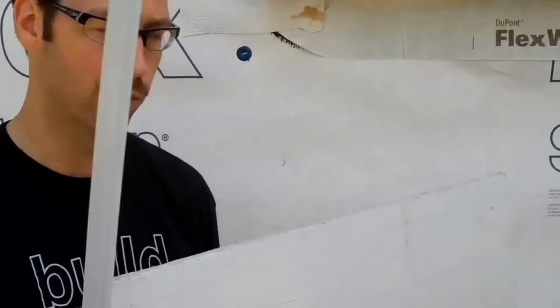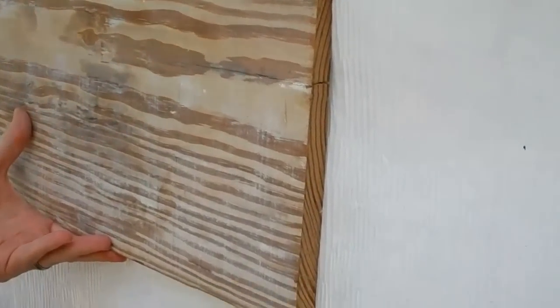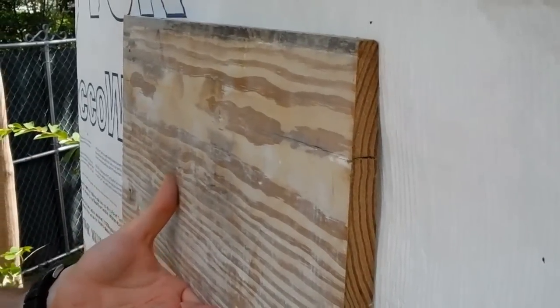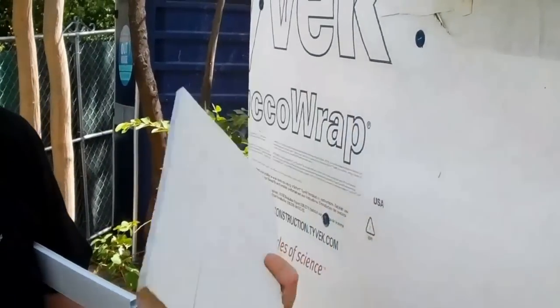There was solid shiplap sheathing behind that, and really, in effect, this siding could dry to the back or to the front. If we were to just apply the siding directly on the Tyvek like this, or directly on the foam board in this case, there'd be no ability for this siding to dry to the front of the siding, only to the back. So even this beautiful old longleaf would have a tendency to cup. There could be rot issues. There could be all kinds of other issues.